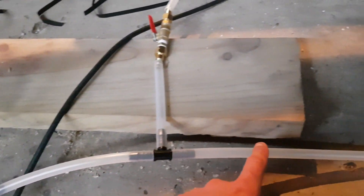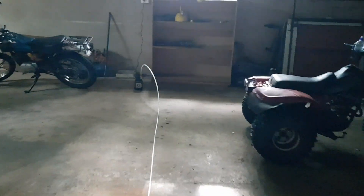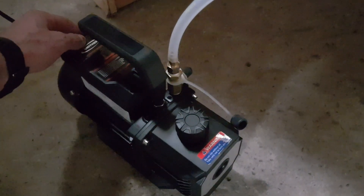This suction is going to be 0.4 bar because it's connected to a vacuum pump, which basically sucks air all the way through until it becomes a vacuum. This stays on through the entire drying process. So that's the plan — take one, let's see how it goes. Pretty excited.